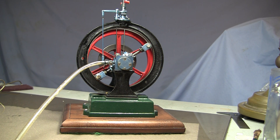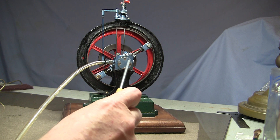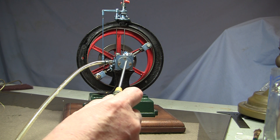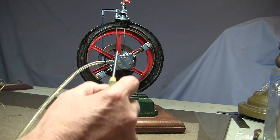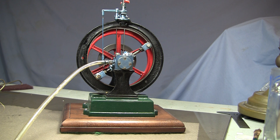This is a model of a W.A. Coomer's rotary engine that was built from castings supplied by Brunel Model Engineering. The way these work is the air is admitted through here. Behind this cover is a bushing with two chambers cut out of it, two slots for the inlet and the exhaust. The shaft itself is hollow with a divider in it, and that is how the air gets supplied through a single hole through each side of the shaft.